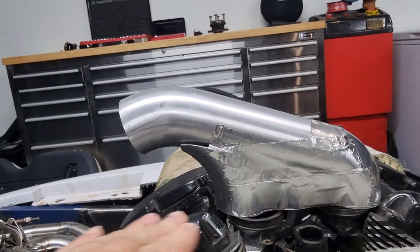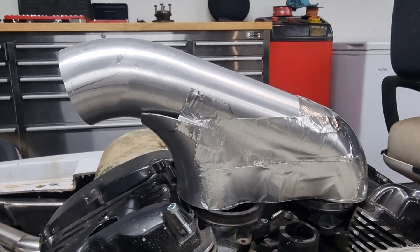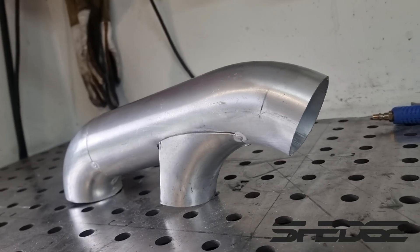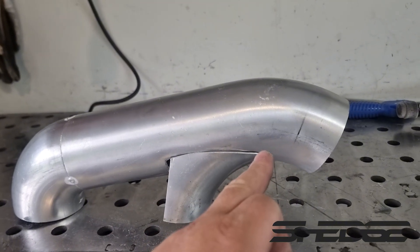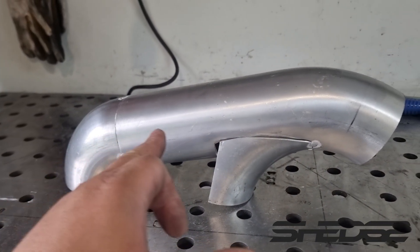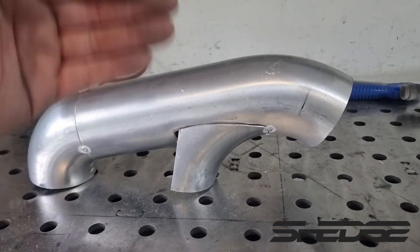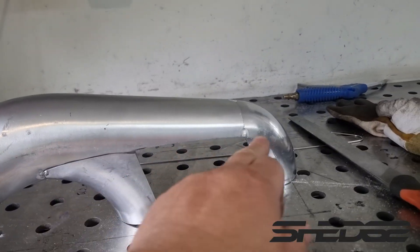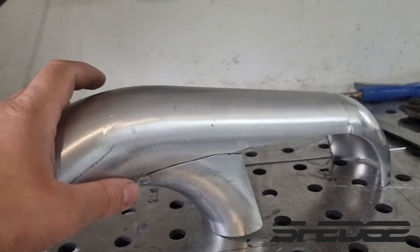With that cut off the bottom we're still going to roughly be around 1.5 times the volume of the motor, so should be good to go. Here goes the first three parts of the plenum all tacked up. We're not too fussed about the fit-up because this section is going to get cut off anyway. We'll cut that out, cut some of this off, add a bit of flat plate to box in the sides, and then weld the base on. Now that it's cut out you can see it's starting to look like a plenum. We need to make up some sides - trace out some two-mil plate and cut off that excessive material.